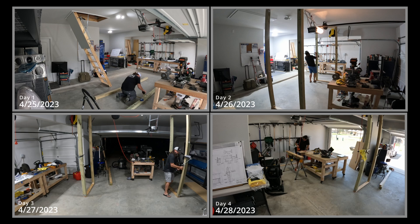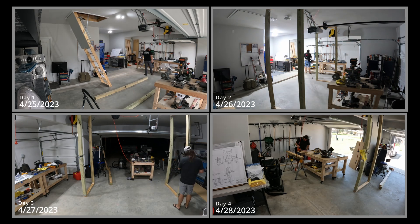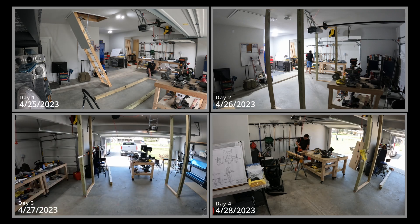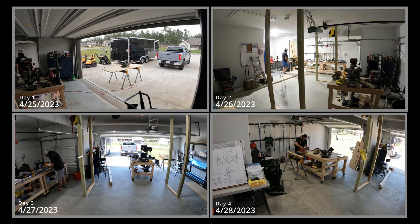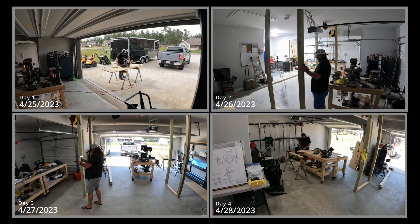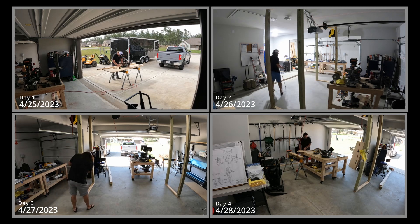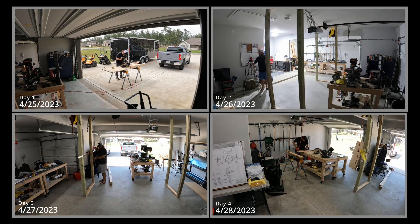You can see I did get the posts set, and in the top right I'm using a laser level — those things are dead-on, nuts level and flush. Then in day three I'm fabricating the arms using threaded rods so I can fine-tune the level of every one of those arms once there's some weight on them. From one post to the next, laterally across everything, it's just perfectly plumb and I'm amazed — this is not something I'm accustomed to building.